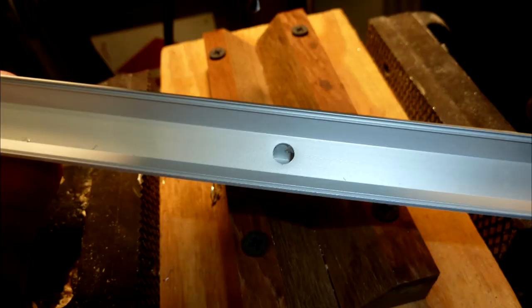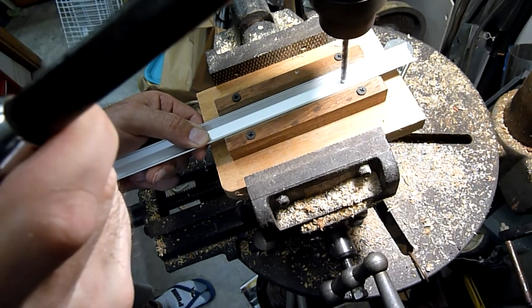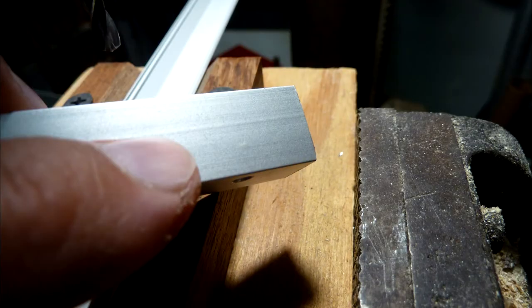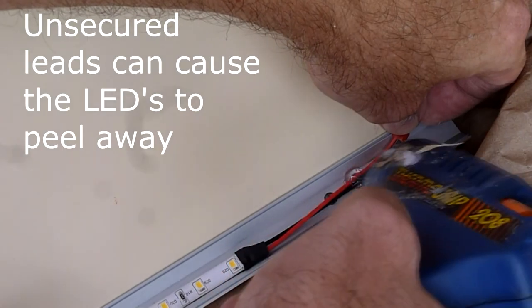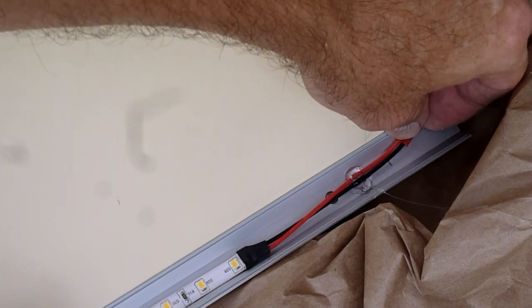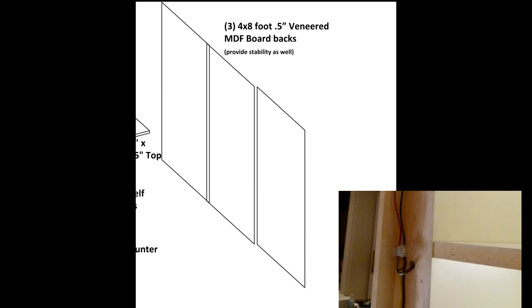To do this, I decided on drilling holes into the aluminum bracket and screwing it in. Fortunately, this particular aluminum came with some really tiny screws. A jig had to be created because there was so little distance between the drill head and the aluminum. If you went too far, it actually marred the front and was visible. In the end, it worked out great. An extra hole was drilled in the aluminum so that the wire off the end of the LED could be attached with hot glue.